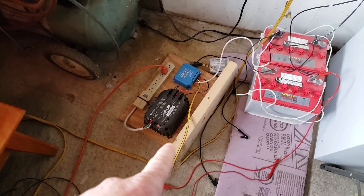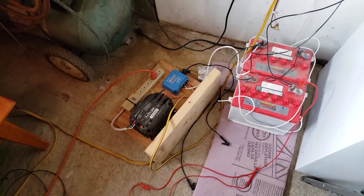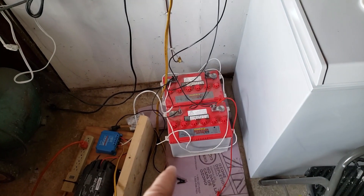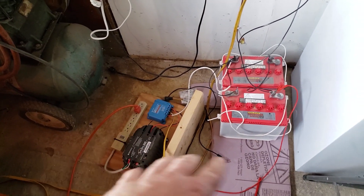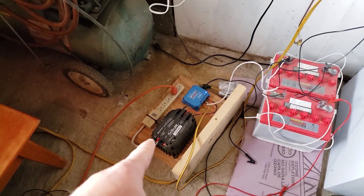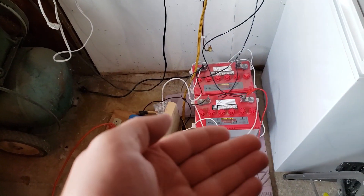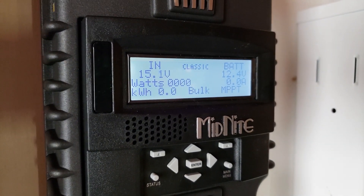I had my inverter on and running last night just to use a little bit of the power in the form of heat — I was powering some incandescent light bulbs over in my shop. I wake up this morning, check the voltage and it's at 12.4 volts, which is like the resting rate it recovers to after shutting off at the kill point, which I set at 12 volts. The volts for the turbine are really low, so let's go see what's going on.